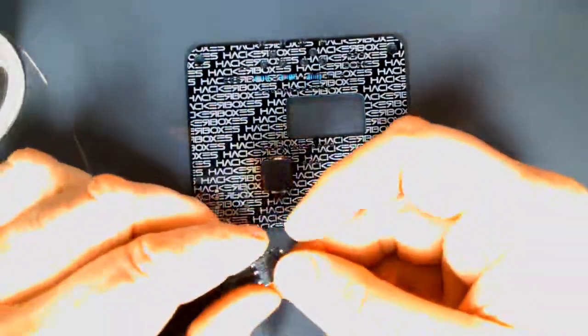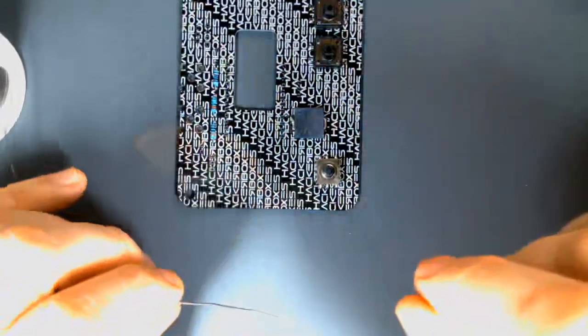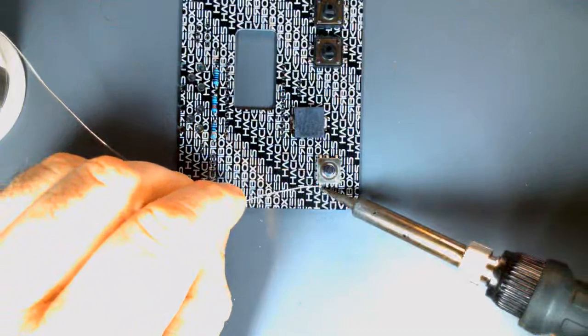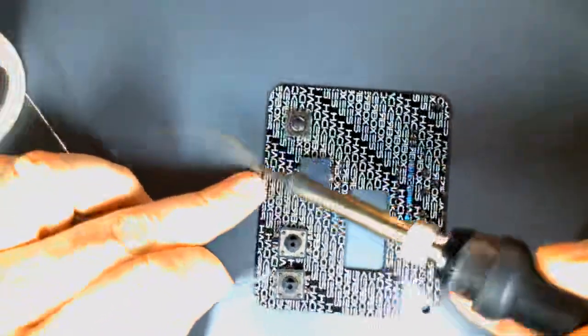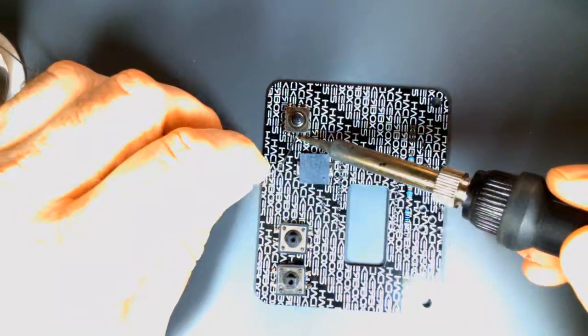Next is the little joystick, which looks similar to the buttons but has more leads because it's a five-way joystick — leads for up, down, left, right, center (push straight down), and a common lead. If you check the schematic, the common lead on the five-way joystick is grounded, meaning the other terminals will float. You should pull them up using the INPUT_PULLUP definition when declaring the pins in Arduino. Then when you close a contact it goes to ground, overcoming the pullup and going to zero, so open contacts read high and closed contacts read low.